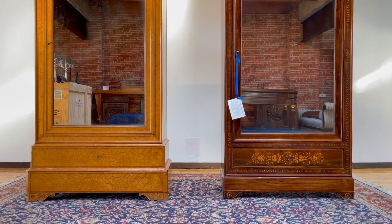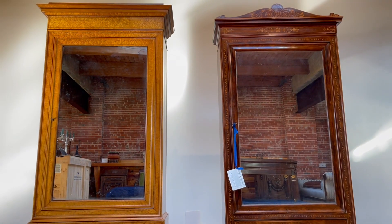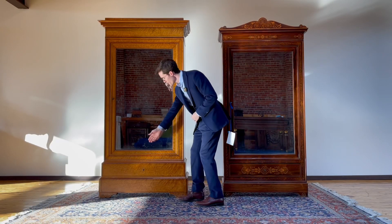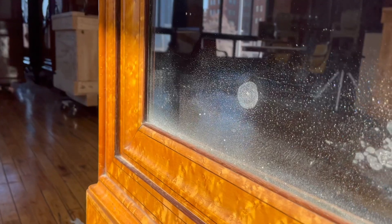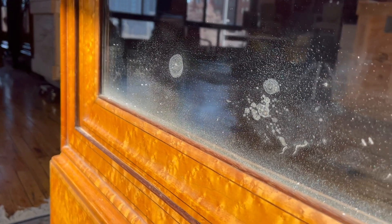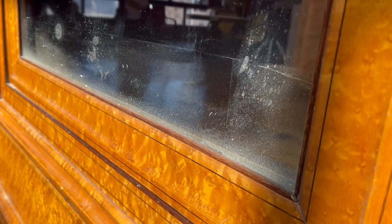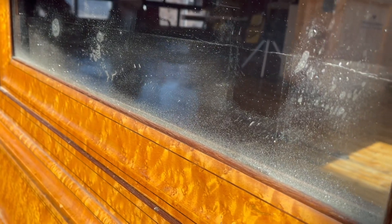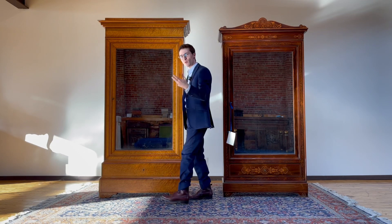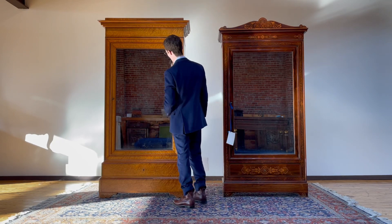These are two veneered works of art — des meubles d'ébenisterie, works of veneer art in French — which were made in Paris. To begin, the star of the show is the original mercury-glazed mirrors. We can take a look at this wonderful sparkle that shows up down here at the bottom. Both of these mirrors have that, and both present just enough humidity damage such that this sparkle appears, but not so much humidity damage that the mirror is peppered with little rotten spots. There's just one or two little rotten spots from humidity, which is kind of what we want to see on a 200-year-old mirror.